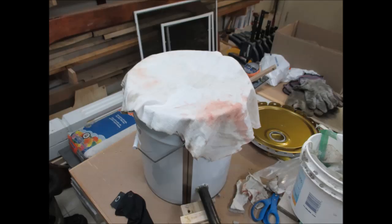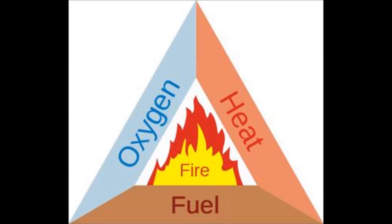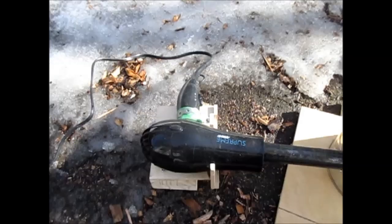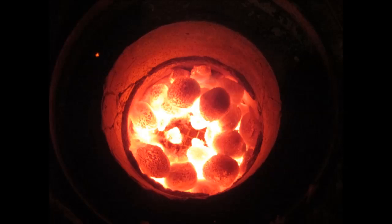Let the mortar dry for at least 24 hours, then fire it slowly to harden the mortar. As you know, combustion requires air to occur. The amount of air available influences the intensity of the heat. So there's a pipe in the bottom where air is blown inside. I simply used a cheap air blower and made a quick support. I added a grid in the bottom so that air is evenly distributed on the charcoal. After a couple of tests, the heat was sufficient to melt aluminum. Depending on the amount of air blown inside, the furnace generates 5 to 10 kilowatts of heat and reaches 1000°C.